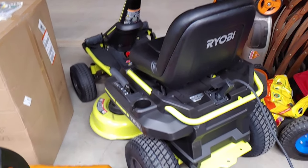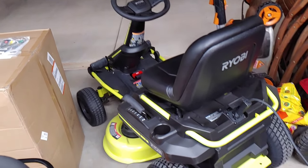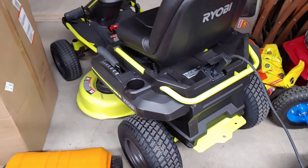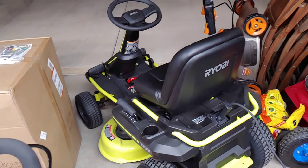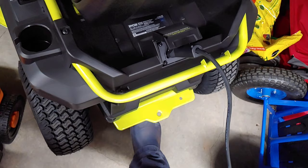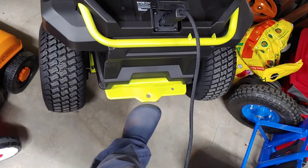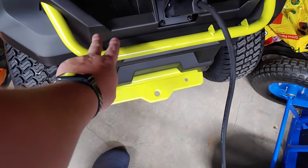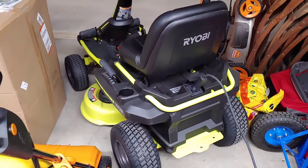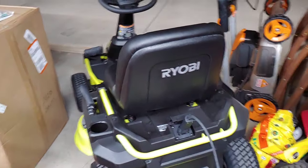Changing the blades - you've got to take the deck off or raise up the front. I'm going to try to utilize this bar here and pick up the front because I can pick it up - it's pretty easy. It's almost 500 pounds, 400-something pounds, pretty heavy. The largest model is like 600-something pounds - the batteries add a lot of weight. I could pick it up on the front by the handle in the middle, pivot that back, and put a block of wood on each side so I don't bend the toe plate. Then the top part rests on this bar to give access to the deck to swap out the mulching blades for the bagger blades. That box is the bagger - it goes into this hole and section here, and then you have your two bags.